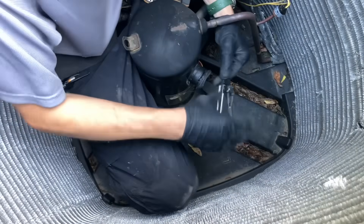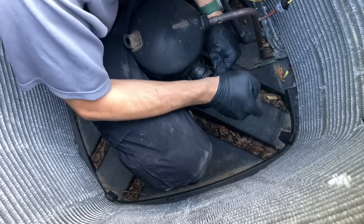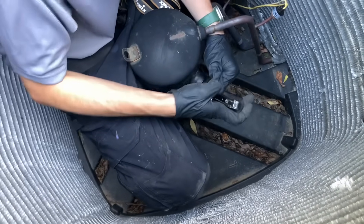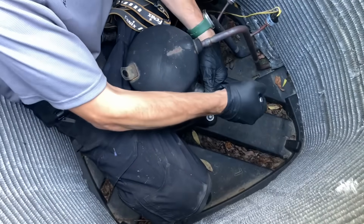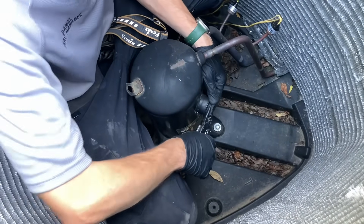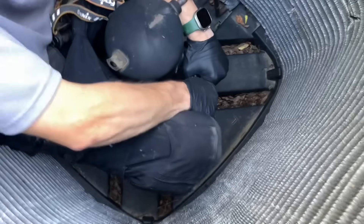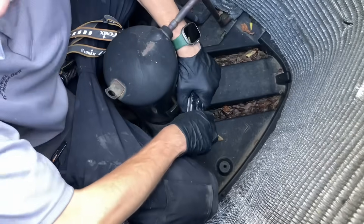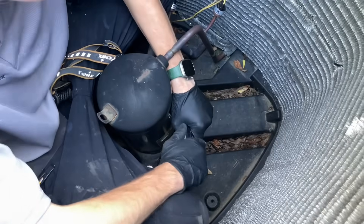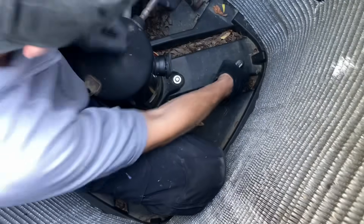That is insane. Did we check resistance on this thing? No, I just came out here to the unit. I've been at the indoor unit, and we did the thermostats. Indoor fan motor died — took a compressor with it. Yeah, I bet that's what happened. Makes sense.